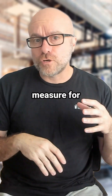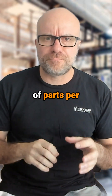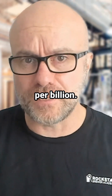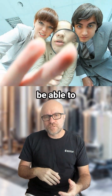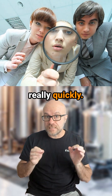The unit of measure for dissolved oxygen is parts per billion. You've probably heard of parts per million doing your water chemistry before, but DO is measured in parts per billion. When the tolerances for dissolved oxygen are so tiny, the instruments required to measure such small amounts of oxygen become really expensive really quickly.